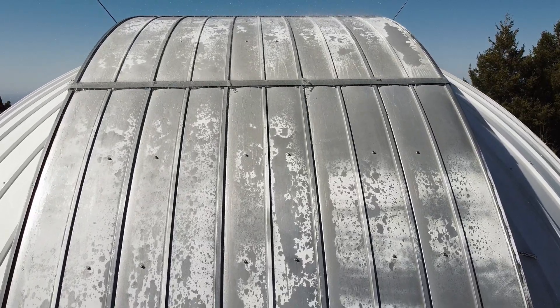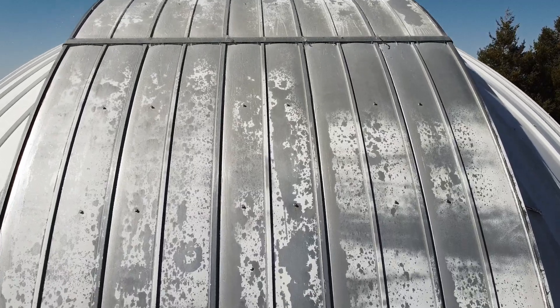The leak test was successful, but we did find one more spot. It's actually between two of the upper shutter sections. These really large Ash domes actually have an upper shutter made out of sometimes two, sometimes three sections. Because of some damage sometime in the last 50 years of this dome's operation, there's a little bit more of a gap there than otherwise expected. They're up there right now on the boom lift getting that nice and sealed up, and we'll have another leak test.